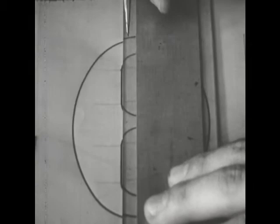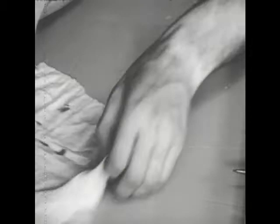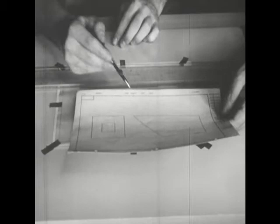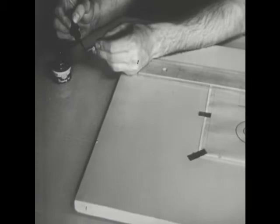When an interruption occurs, the pen should be wiped clean at once to prevent the ink from drying in the pen and to be sure of having the pen ready for use when the interruption is gone. The pen may be cleaned without changing the setting by folding a corner on the wiping cloth and drawing it between the nibs. Ink spots on the outside of the nibs should be removed at the same time. Because the pen was wiped clean before stopping, refilling permits tracing to continue.